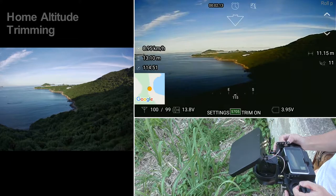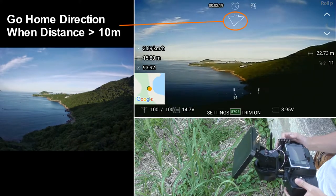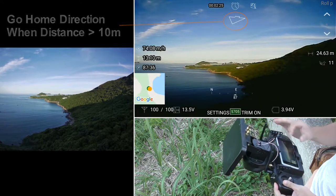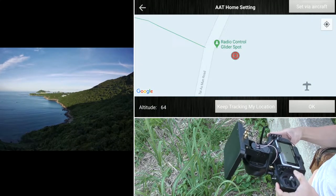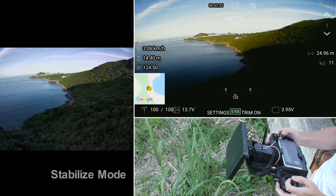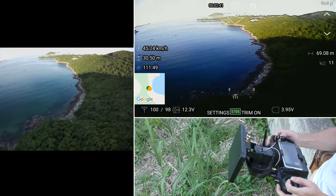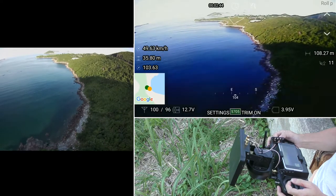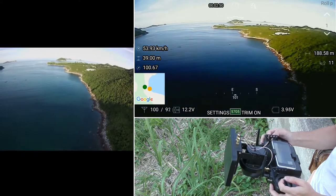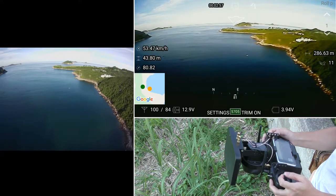Before I head to the remote island, I switch it to GPS position home mode to see if I need to trim the home altitude or X-direction offset for the AAT. Since the GPS altitude is normally not very accurate, it will make the AAT aim a little too high or too low. Home altitude can be trimmed with the up or down trimming button of the left side stick while holding the VTX button. For some older Android phones it's hard to calibrate the compass accurately, so by holding the VTX button you can adjust the X-direction offset with the left or right trimming button. We already have another video showing how accurate and consistent the AAT is — find the YouTube link in the description below.